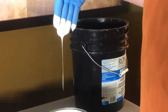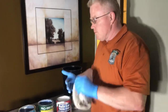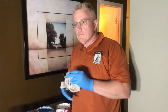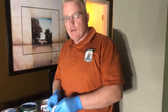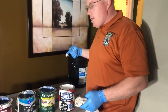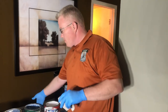I will show you what it looks like going on the wall — pretty thick, right? Keep that idea in mind that it's thick. When you're going over new joint compound or sheetrock, you don't want something thick. What do you think a thick primer is going to do on a very porous, dry joint compound surface? Do you think this stuff is thin enough to penetrate all of the pores on joint compound? If you do, you're wrong.